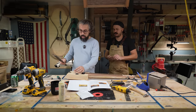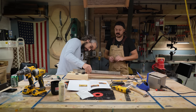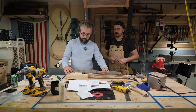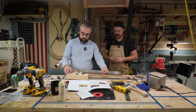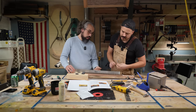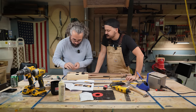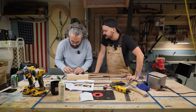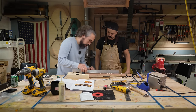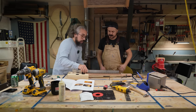This should be pretty much dialed in. The height of this block should be set up so that when we run the straight edge on here, the action is actually going to be pretty high. So what we can do is remove some thickness from underneath this wooden block so that when we put the strings on, the string action is actually usably lower. I've gone ahead and sanded off some material, and now when I set the bridge and saddle on this cigar box guitar, I'm getting the string height I want — just using my eyeballs here.